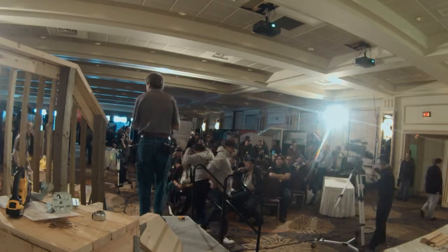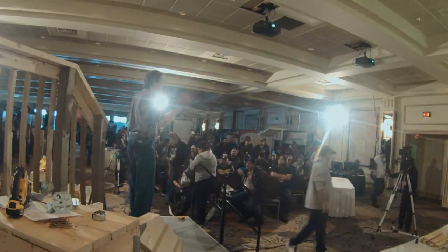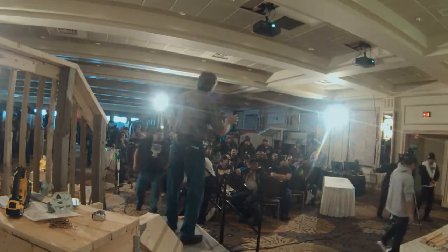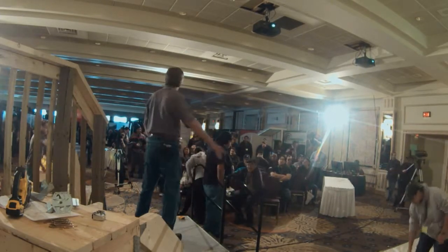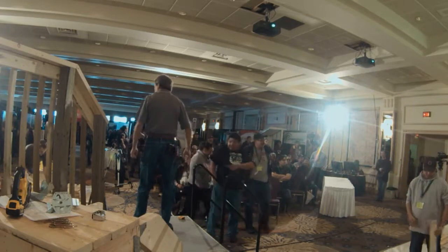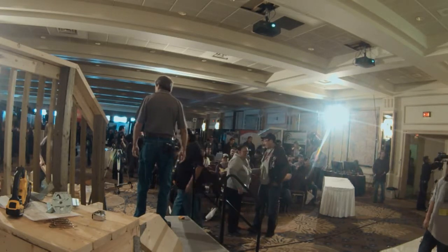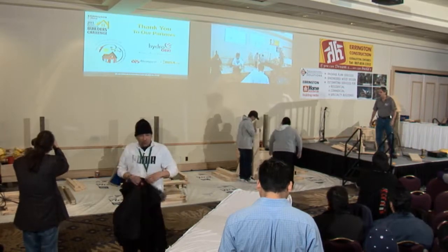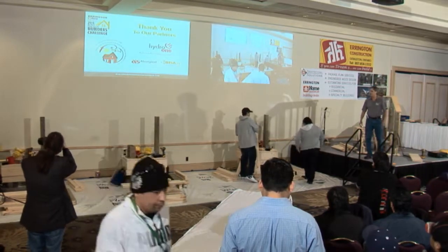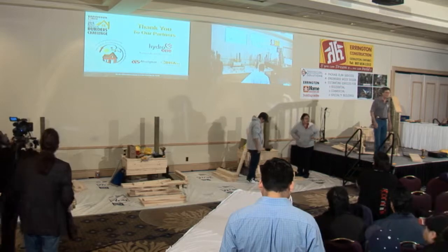Now, the first thing you probably want to do is identify there are 2 big pieces of wood that aren't cut. One is the one that goes on the floor, and the other one is the stringer. Don't mix them up. Which is the longest one, Chris? One says stringer, and the other one, okay, it says stringer. Okay, so the stringer is the one that we got to cut the notches out of.